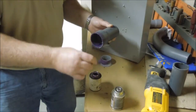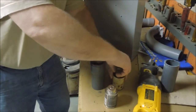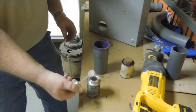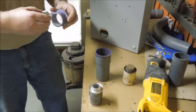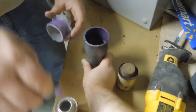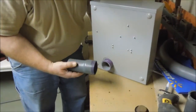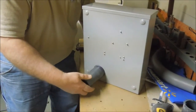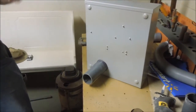So when you wonder why there's purple stuff all over your pipe — the plumber says I don't want to have a problem, I'm going to make sure he sees it. It's your plumber saying we don't want to do this twice because the second time is free. We just slip this little insert right in there, put that over it, give it a little twist, make sure we've got a good spread of the glue around the fitting, and then we let it sit. That's how you glue PVC pipe.